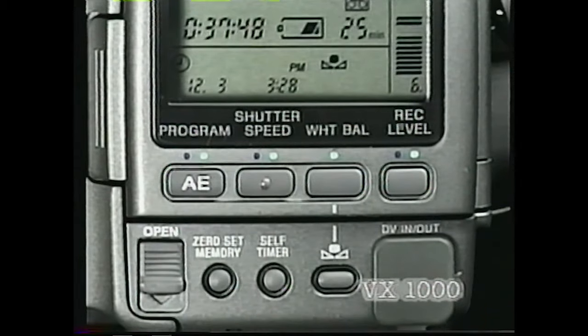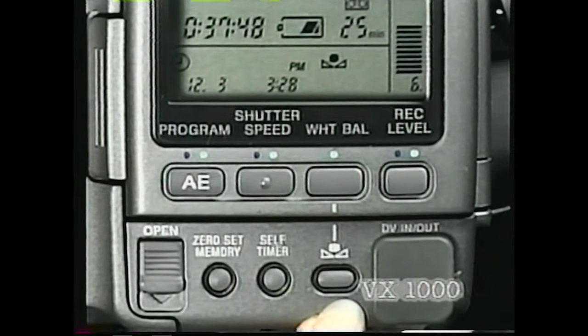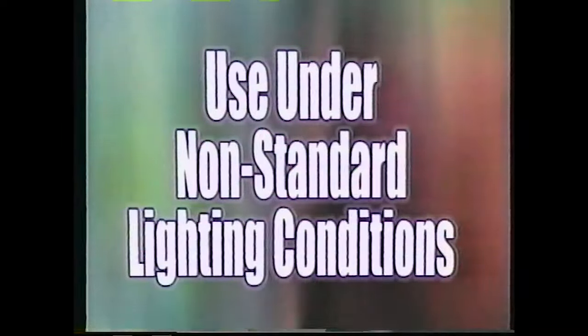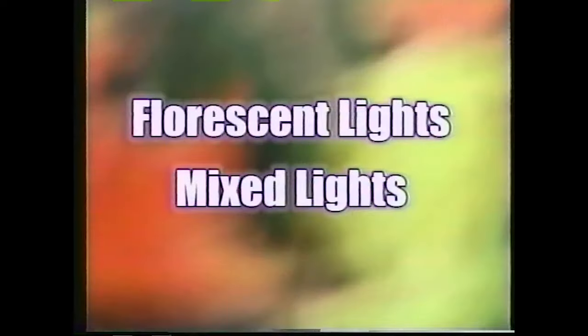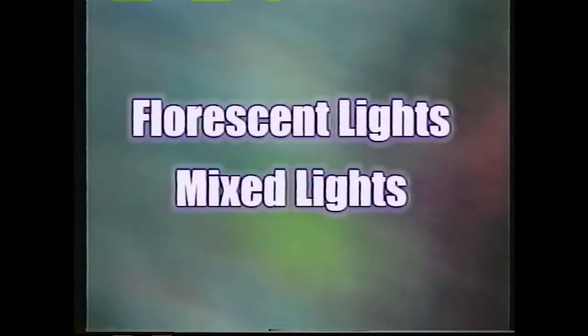Press the white balance button once more, and with the VX1000 you have the one push white balance symbol. This is the same symbol that appears on this button, and this is for manually setting your white balance. And you should use it whenever you're shooting under standard fluorescent lights. There are daylight balanced fluorescent tubes, which are close to sunlight, but for most fluorescents, you should manually white balance the camcorder. You should also manually white balance if you're in a mixed light situation with some sunlight, some incandescent light, and some fluorescent light.